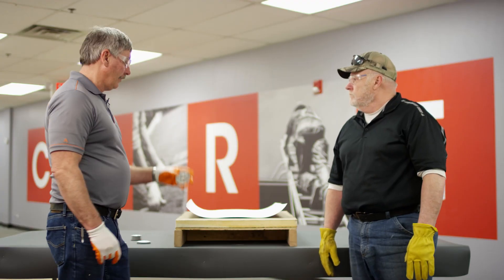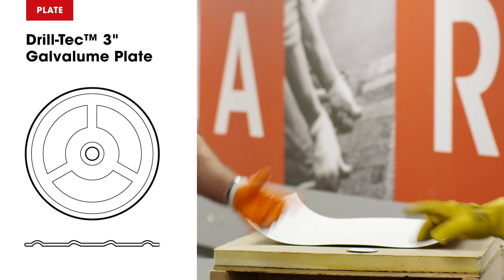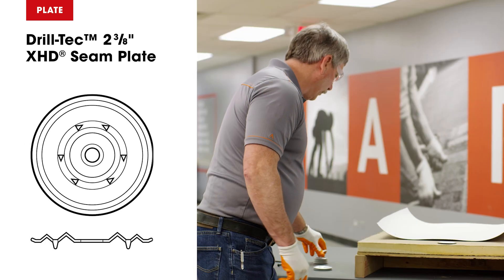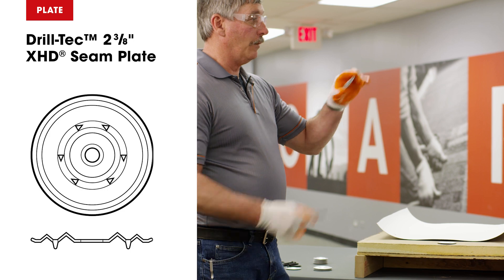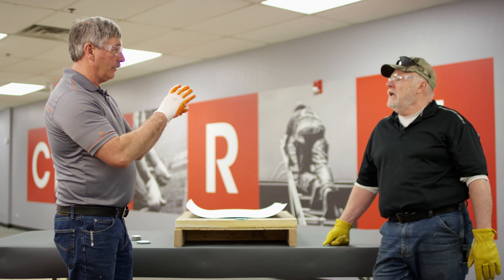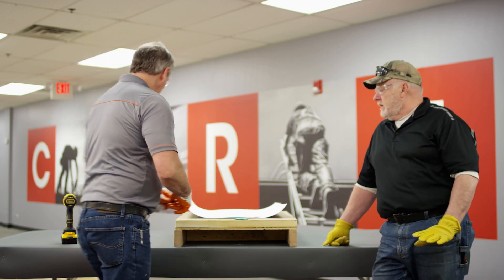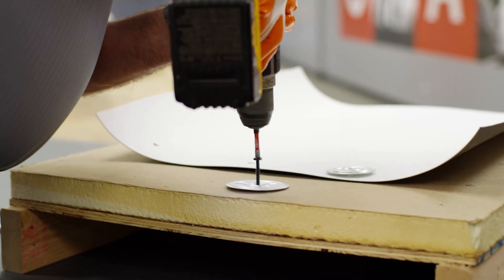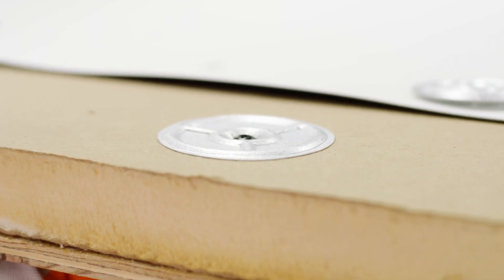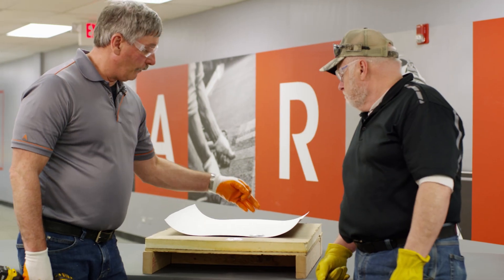We're using the same plates: an insulation plate, which is a three inch recessed plate, and we're going to use a barb plate for the sheet depending on what you need for wind uplift. It could be the bigger plate — two and three quarter or whatever — as long as it has barbs on it. Now we've screwed our insulation in.